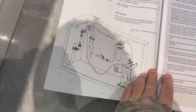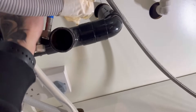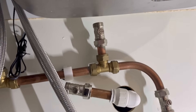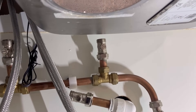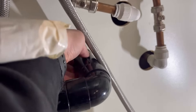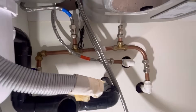That's the tap all bolted in now. I'm going to do the easy bits first - so that is just the hot and cold, which is obviously blue and red on here. Just tighten them on to the old ball valves, and that's that bit done and out of the way. Then we'll move on to this filter. There was a spare isolation valve there - on the cold. I think it's a hot tap, looking at this piece of solvent weld they glued over the pipe. So that's the hot and cold connected back up.